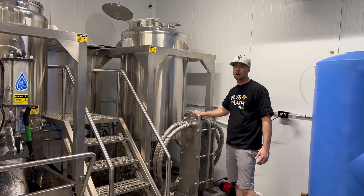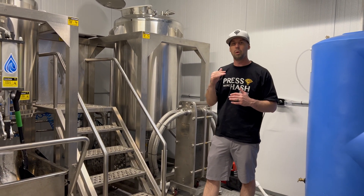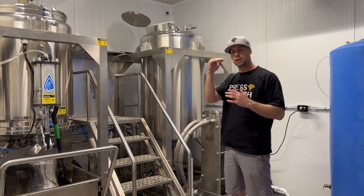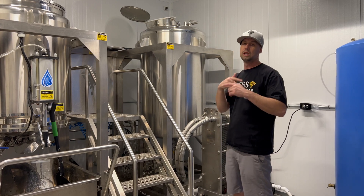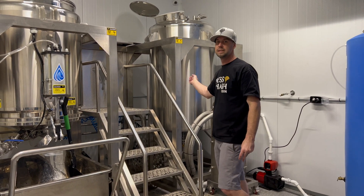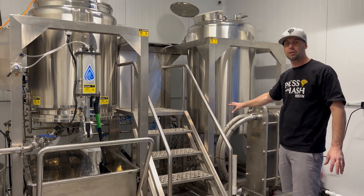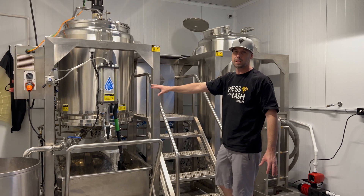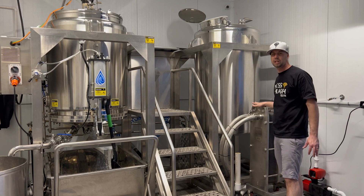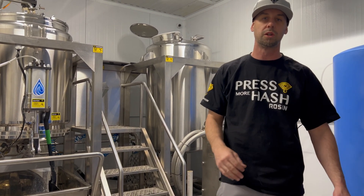It's going to run through our heat exchanger at 32 degrees. We have our chiller set point at 33 with a one-degree bandwidth. So we're going to pull it down to 32, walk it up to 33, and pull it back down to 32, exchanging that heat and releasing the heat from our chilled tank. Every bit of water coming out of our system — touching hash material or the smart agitation gear — goes through our heat exchanger. So at any given point, we are guaranteed to spray 32-degree water.